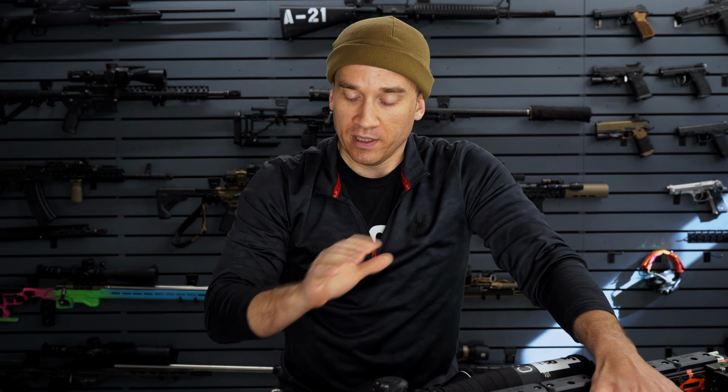That, I would say, is the deviation from the standard ejection method that you probably think of. And so I would say from a functional standpoint, that is one of the large differences that you need to consider. So you have your interchangeable or not bolt heads, you have your throw, how far the bolt needs to cam over, and then your ejection method. I think those three things represent the biggest functional differences between the actions, and you really just have to decide on those three things and then price.